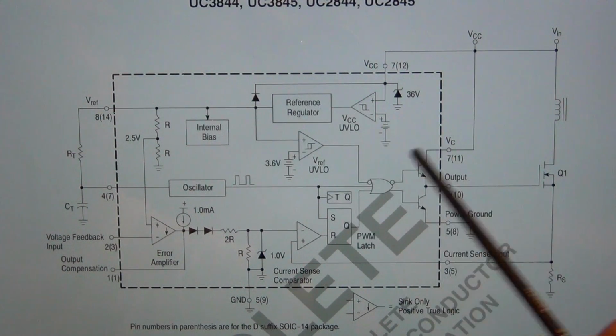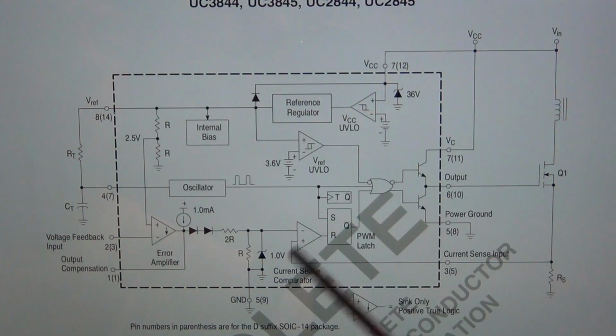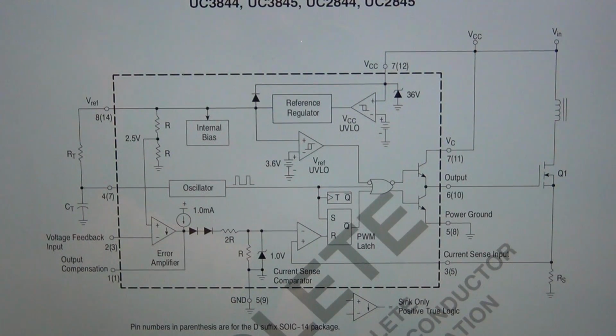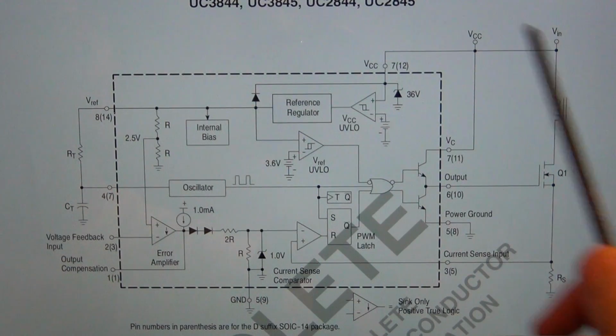And there's some other protection circuitry in there. If the voltage reference is incorrect, it disables it permanently, and you can add some additional circuitry here to generate shutdown and all the other fancy things that are of course on that power supply. So you can disable it, so when the power supply is not running, when it's only generating the standby, this is not on.